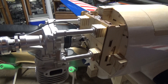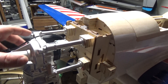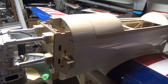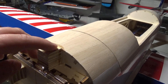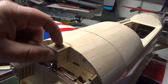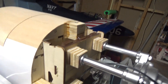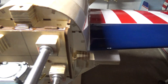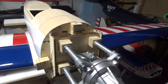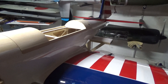I know some were interested in the engine setup. I'm using cheap plywood from the hardware store — I know I'm going to get a lot of grief for that — but I've been using it for years and it's never let me down, especially if you know how to use it and soak it right with CA to really stiffen it up. One of the biggest issues is if you just try to drill and tap this, the threads are not going to be very strong because of the type of plywood it is. But I seal the threads when I'm done so they're in there — pretty stout.